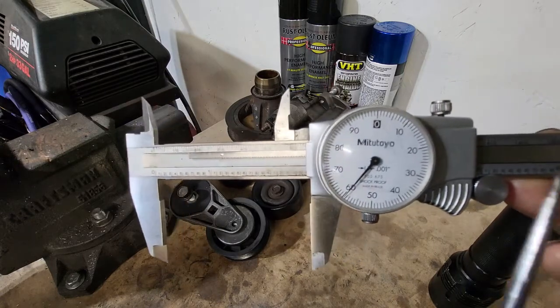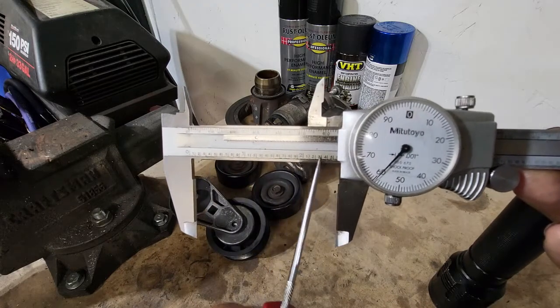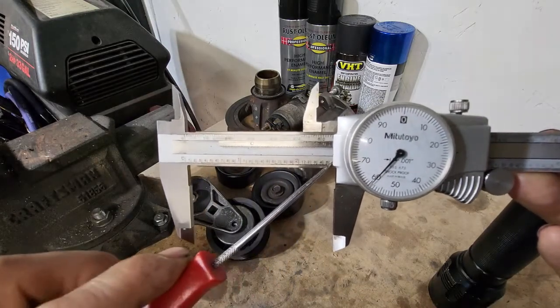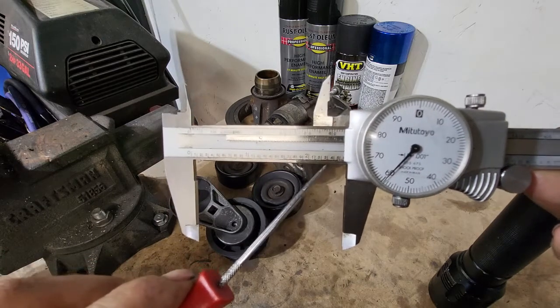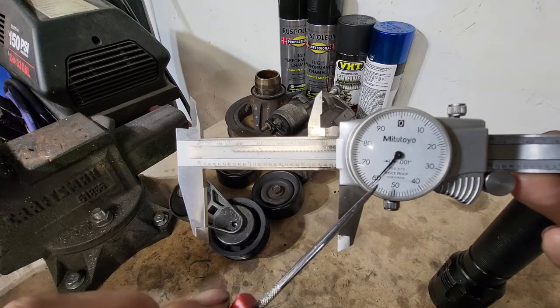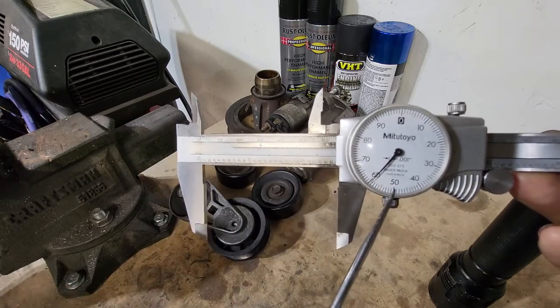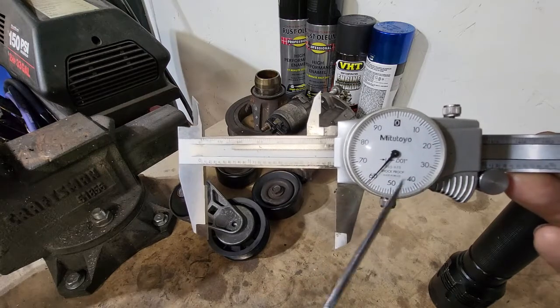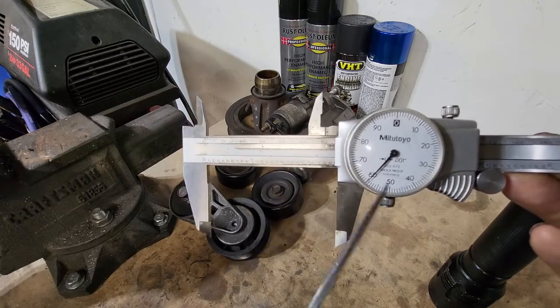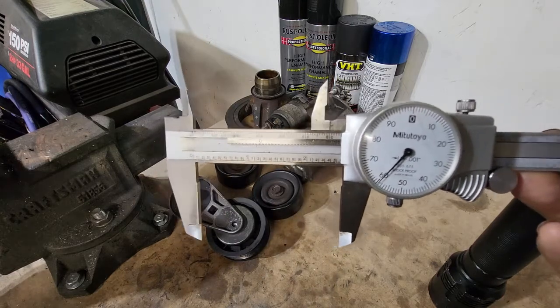Like I was saying, this stuff's not complicated. You're just looking at complete numbers. You don't want to look underneath, try to, oh, I can almost see the 6. You have to see a whole number for it to count. And then you just look at the dial, count it. Start with your biggest number first, 2 inches, 500, 510, you can go all the way around, 2 inches, 559. It's that easy.